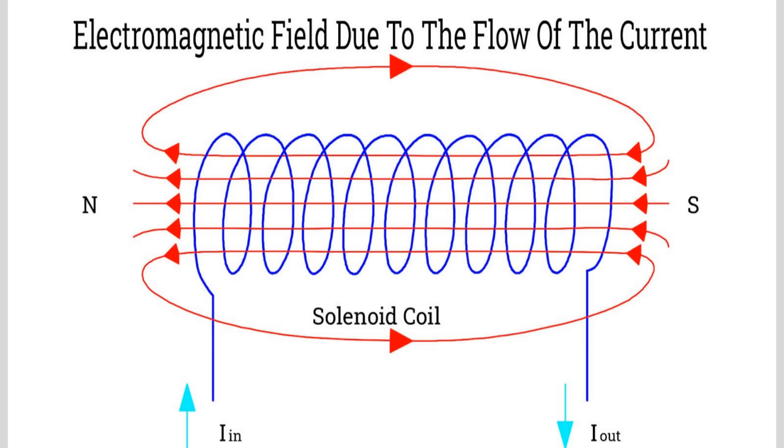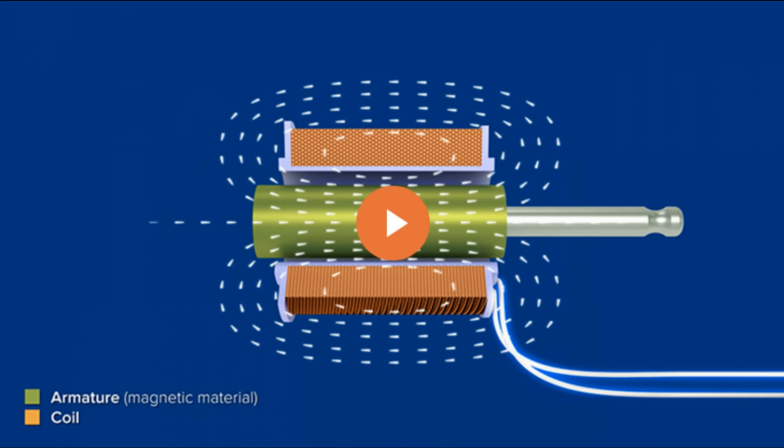That creates motors that are relatively heavy. There is a third kind of motor called the circumferential flux motor, where instead of following the axis or the radius, the field follows the circumference. We know these because that's exactly what a solenoid is - linear generators and linear motors are very little more than solenoids. A solenoid is any coil where the length is greater than the diameter. If you bring a magnet in and out of that coil shape you get a linear generator; put a current through it and you get a linear motor.